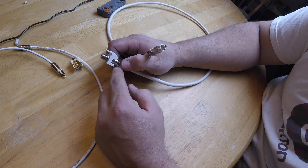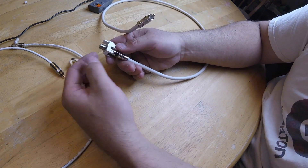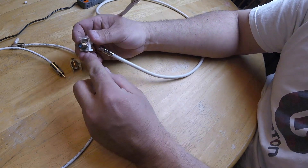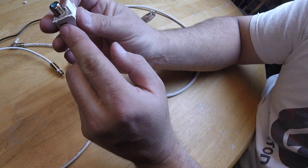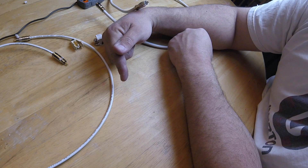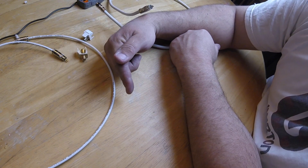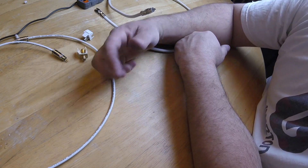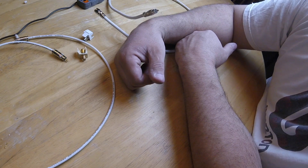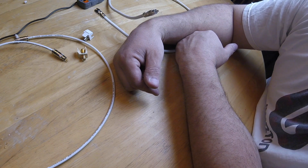You can also do an RCA in the back and an RCA on the front — they make all kinds of different barrels for that. The barrel is the actual metal piece; the keystone is the plastic piece that clicks into the plate; and the barrel is the part that goes inside the keystone — they're interchangeable. There's a little nut on the back of the barrel that locks it in place. Check the description below for Amazon links to get the right stuff. If you click those links, Amazon gives us a small kickback at no extra cost to you, and it helps us keep making videos. Please comment, subscribe, and tell your friends. I'm Alan — today we did AV, now you do AV.